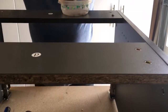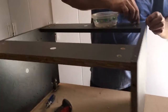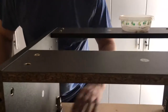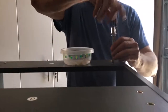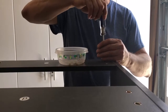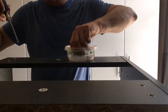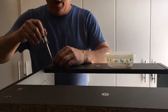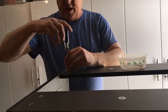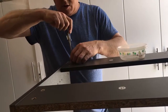And we're going to put in 4 cams. 1, 2, 3, 4. These should also go in with a manual screwdriver, not a power screwdriver, because if you use a power screwdriver, it's very easy to strip these things out. So just hand tight on these. If you've done your height adjustment correctly, then you should get nice tight seams in here. Everything should go together really smoothly. Oops.